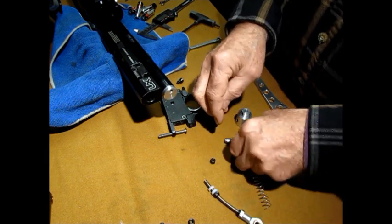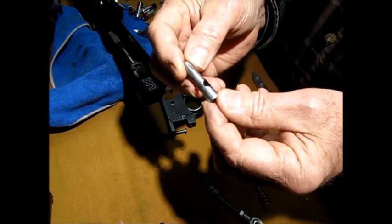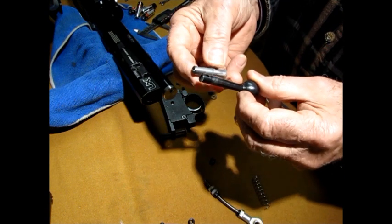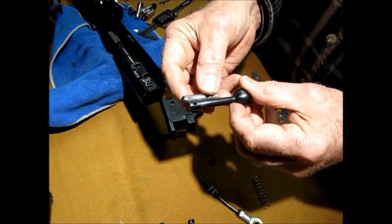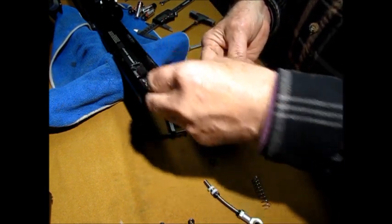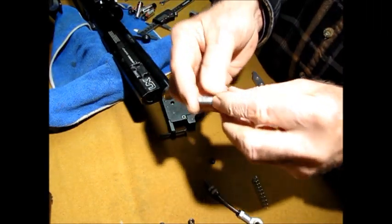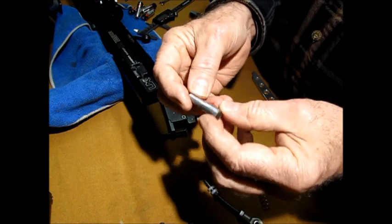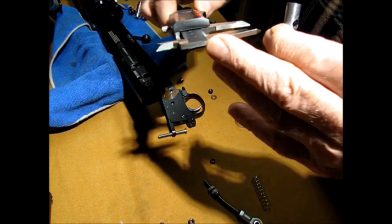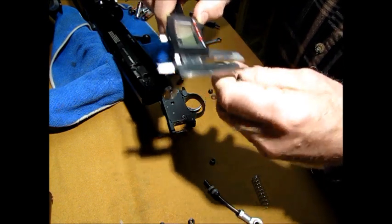Now I'll show you the next thing you have to make. This is the bolt arm, replacing this one. This goes away. You want to retain a little notch in the back so your set screw sets in there properly and holds this thing square like that, parallel with the bolt. Alright, so we get rid of that. This is what you're going to make next, and this is a screwdriver. It's a screwdriver shank, chrome plated if you want. This one here happened to be chrome.